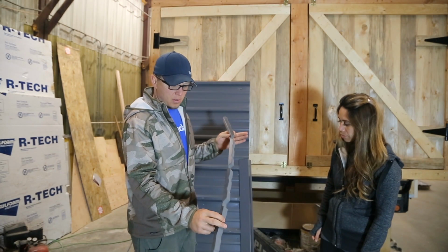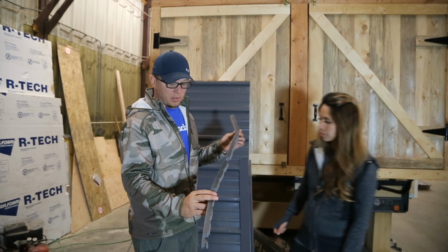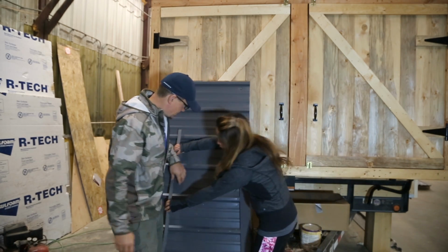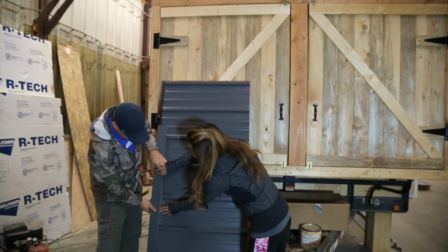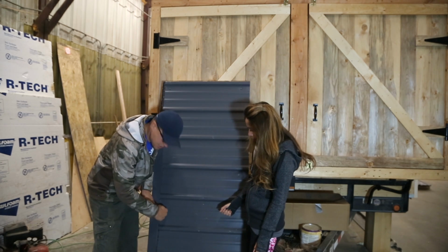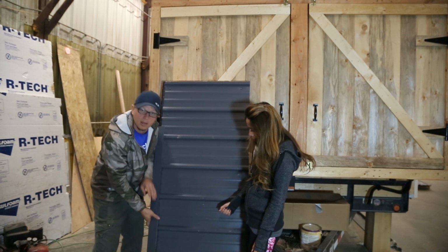This is used for headwall flashing and also for your ridge cap. So how it basically works is you'll put it like this. I'll just pretend this is your headwall. So it'll come there. And then when you screw it down here, this is all sealed up so nothing can get back up underneath the tin and water can't get in there.